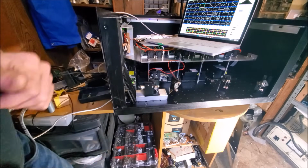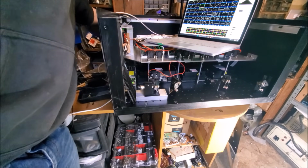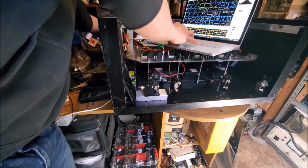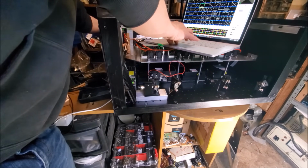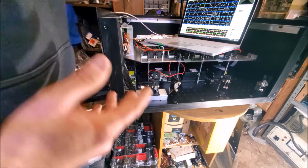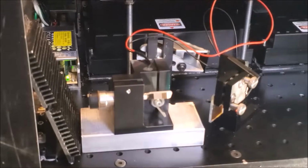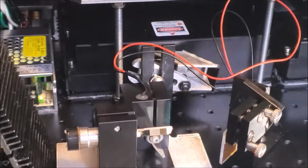We're going to turn down the laser power in the back just to make sure that we don't cook anything. Because once again, we're just doing positioning at this point. Turn down the laser power on the program and enable laser. Now, essentially at this point, all we need to do is line up the red because the red's the biggest one and that's the one we're going to worry about the most. So, zooming on the galvos right here. I'm going to move the camera to get a better view on that.